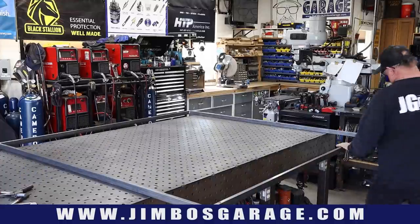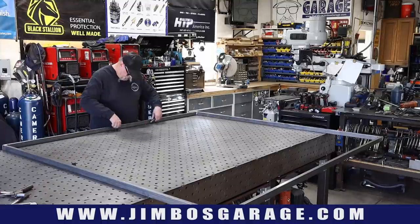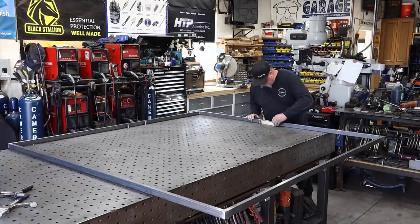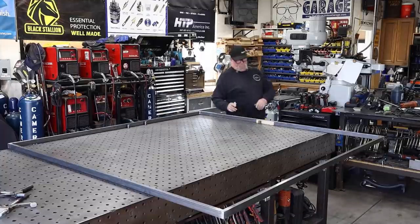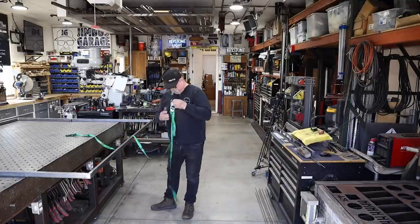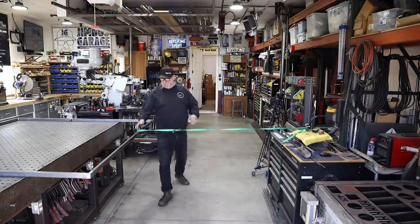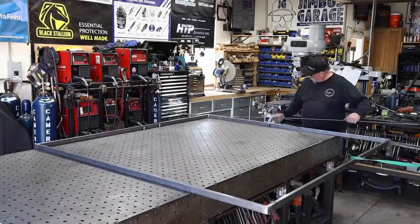All four corners are done, but there's some warpage — not too much, maybe a quarter of an inch over seven feet. I've got to try to pull this as straight as I can because the opening is such a tight fit measurement-wise that the frame has to be straight to get in there. I've got shims against it one way and I'm pulling against it the other way. I even had to use a ratchet strap, reaching across my shop to find a post and pull it in a little bit.